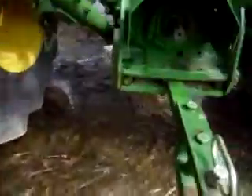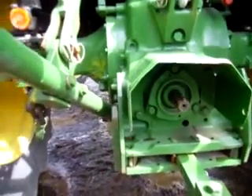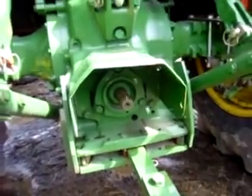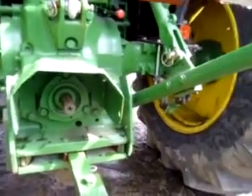The PTO spins, but as soon as it's under load it does stop. I'm told it's a brake band, but even if you replace them they don't last two minutes, so I've not touched it.